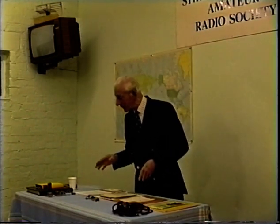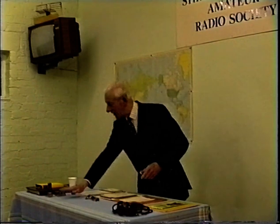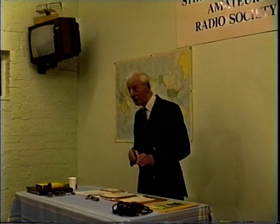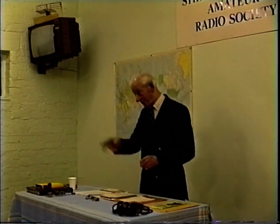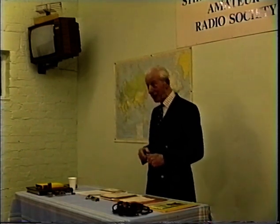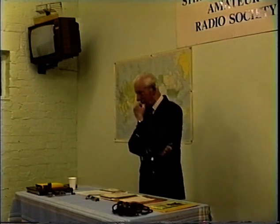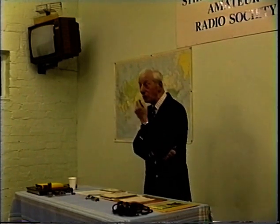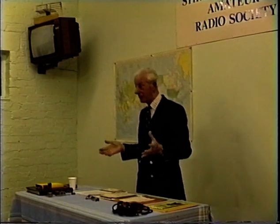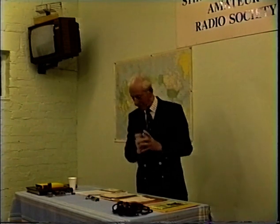I was really on a winner. But I had no other valve I thought would make an oscillator. I wasn't sure if the crystals would work — if you make a mistake grinding them, they're no longer active, they're a goner. So I thought, I'll try the crystals later but I'll get something going first. I kept thinking, what would be the simplest oscillator circuit for 40 metres? I could use the 6L6 as a doubler and final amplifier tube. I decided the simplest circuit of all is probably a Hartley oscillator — maybe not a big set, but it does work.